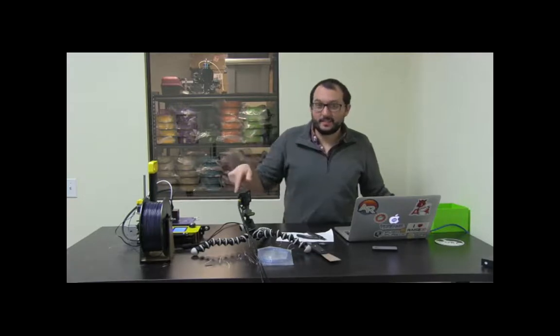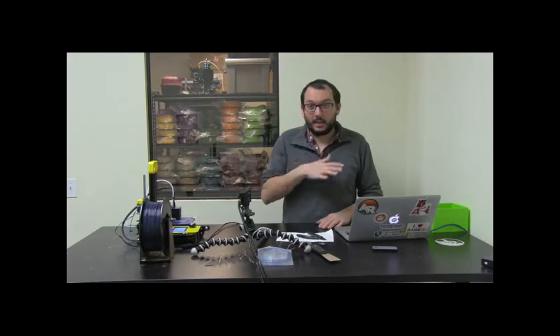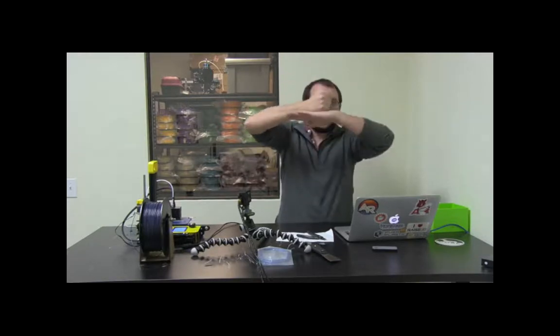So that's great. You'll do the same leveling thing that we did with these with the paper. And then you can feel the tension, and you can even adjust it a tiny bit while it's printing those first couple layers, until it looks good. That's called hot leveling, and you can do that on ours as well. You can move those knobs a little bit until you see the filament coming out at a 90 degree angle as it's moving out. Once you get it looking good, you can stop the print, clear off that cruddy filament, and hit print again, and it'll be level exactly to where you need it. That helps sometimes too.